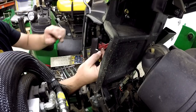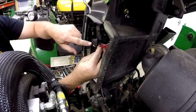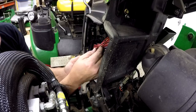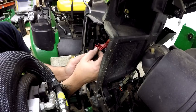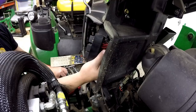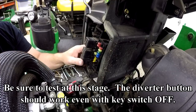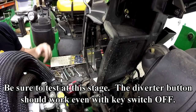Okay, so back up to the power side. We've got our connector, as we've seen. This is the way I'm going to stick it in, with this little knob here toward the inside. So we'll stick it in like that. It feels locked, it won't come back out now, but I wasn't really confident in it until I shoved the fuse in. And then it seemed even more rock solid, like it wasn't going to come out. So now all we have to do is go back together. We'll put the fuse block back on with the two bolts, and we should be ready to go.